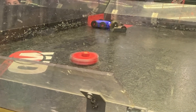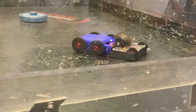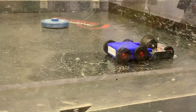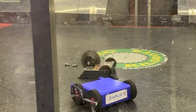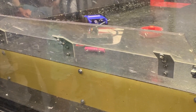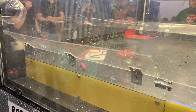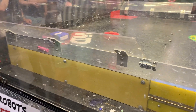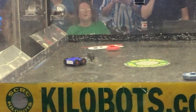At the beginning of this fight, I was able to get a couple good shots at the side of Taserface. I got popped up once by Taserface, and upon driving back at him, my weapon shaft came out of one side and the weapon ceased to function. Since the weapon was my most armored part of the robot, I decided to use it as a shield to try and push into Taserface. The screws ended up falling out because I hadn't loctited them on my backup bar, and the vibration from spinning had caused the screws to back out enough for the axle to slide out. I kept driving into Taserface using the front of my bot as a shield, even getting him into the red hazard twice, before driving into the red hazard myself, which sent me flying into the corner with my weapon bar flying out and losing all my washers like Sonic losing his rings. I figured out I could use my weapon supports to keep his weapon at bay and ended up pushing him around and pinning him up against the wall before the buzzer sounded. It seemed extremely close — he got all the damage, but I was able to control most of the fight. I ended up losing and I can see why.